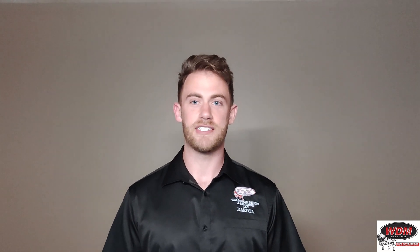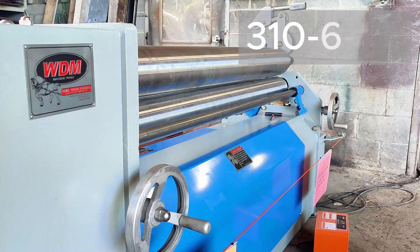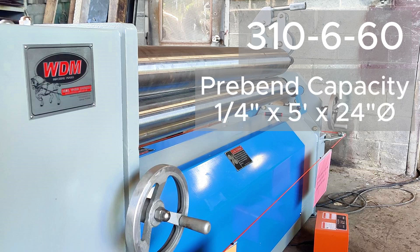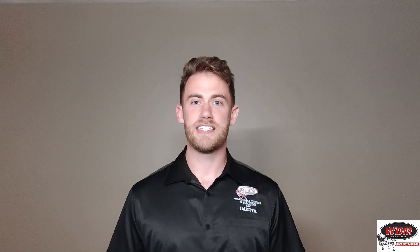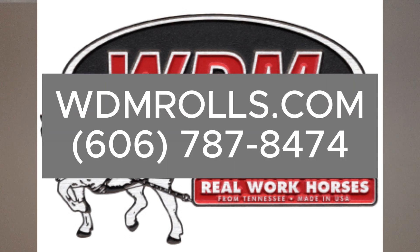I'd like to give a shout out to Valley Welding, a local job shop, for letting us use their plate roll as a demonstration today. The roll used in this video is a 310-660, which has a six-inch diameter top roll, a five-foot working length, and a pre-bend capacity of quarter-inch by five-foot to a 24-inch diameter. The 310 series comes in a range of sizes, so feel free to reach out to us — we can help with your project online at our website or by phone. Happy plate rolling!